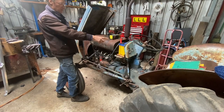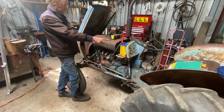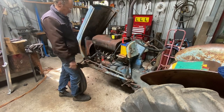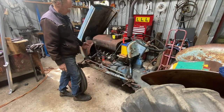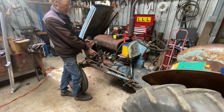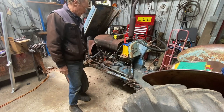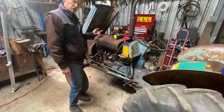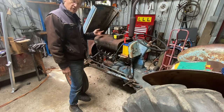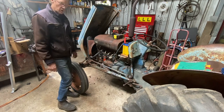I've got the battery charger on here at the moment because that battery doesn't get charged by this machine — it's a six-volt system with a six-volt starter and six-volt generator. We're just going to use a 12-volt battery on that. I'm going to have to decommission the generator and put an alternator on there somehow if you want it to charge.